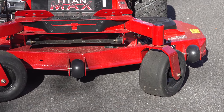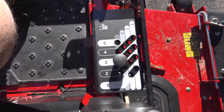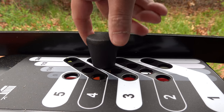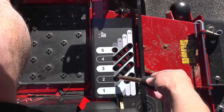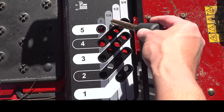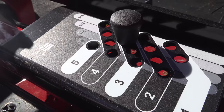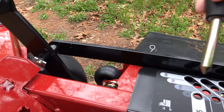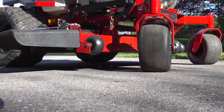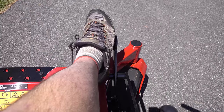Adjusting the cutting height on this deck was surprisingly easy, but it looks super confusing. They have a system where you simply remove one pin and put it into the slot of the height you want to cut. It's marked one to five inches on the left, but you can cut in one quarter inch increments. So if you want to cut the lawn at three and a half inches, you go down to the three inch mark and put it in the one half inch row. The pin is held by a magnet inside, so it stays in the hole really securely. But if you did lose it, you can shove a screwdriver in the hole to allow you to cut the grass until you get a replacement.